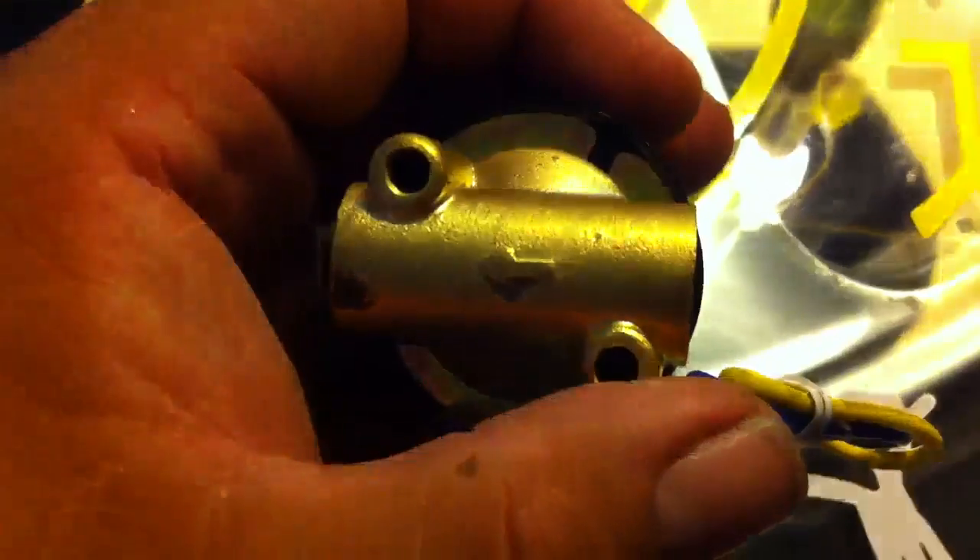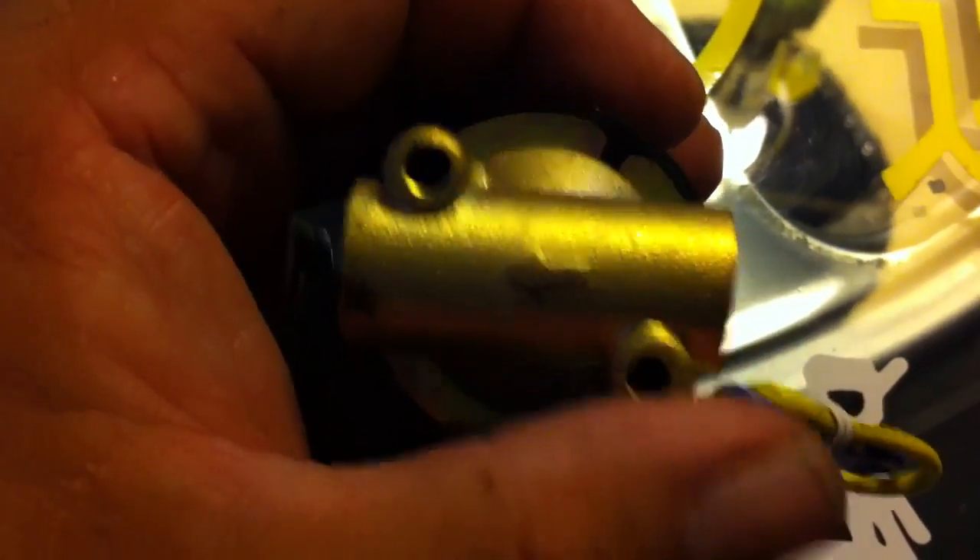It's really simple. There's a magnet in here and there's a shaft that goes down in the center, and when you put power to it, it magnetizes it and pulls the shaft up allowing it to open and airflow through. If you look at the bottom, you can see the direction of airflow right there. See, this one's got an arrow on it — that shows that the air flows through from this side and comes out this side.